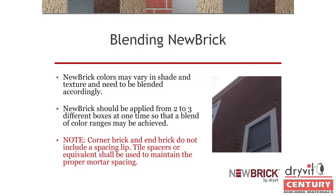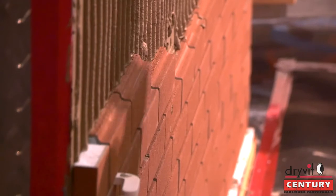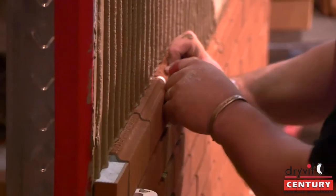When blending your brick, they now come in straps rather than boxes — in bundles. Work from multiple bundles. With conventional brick you'd be working from two or three pallets; with our product, work from multiple bundles, because it's a manufactured product and although very accurate, there can be slight inconsistency in the finish. If blending, give us the percentages when ordering and we'll ship it blended. Lay it out, take a look at the wall, make sure the blend is proper — do it right the first time and you'll never have a problem.